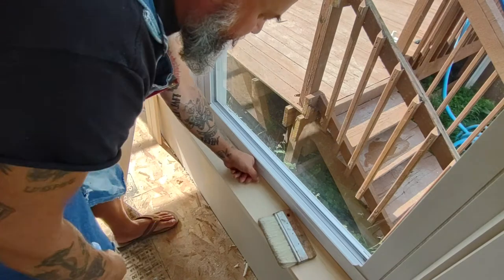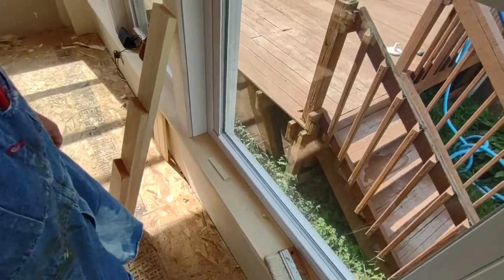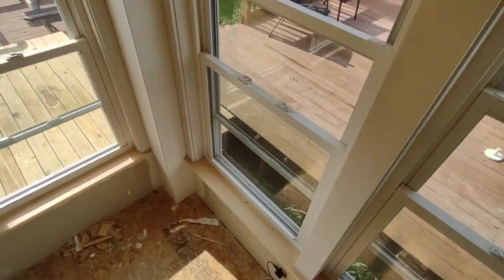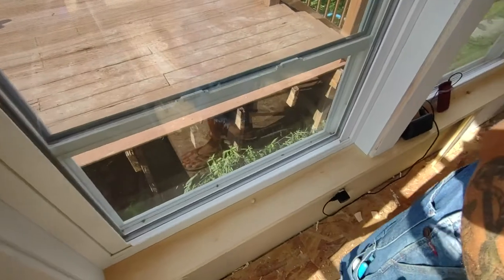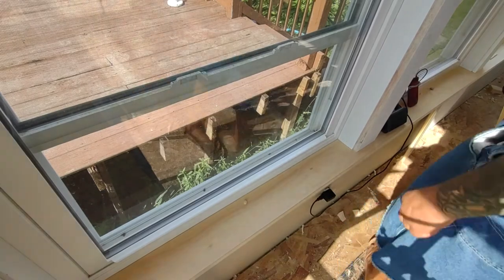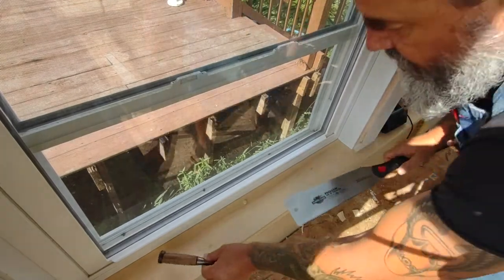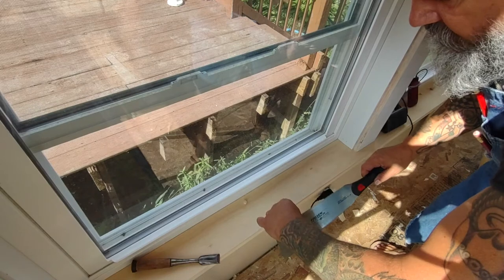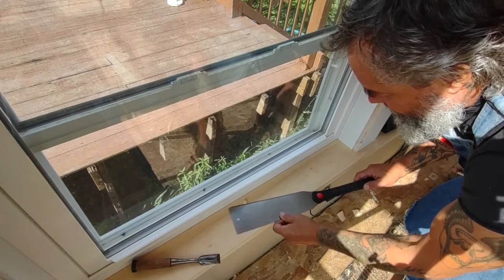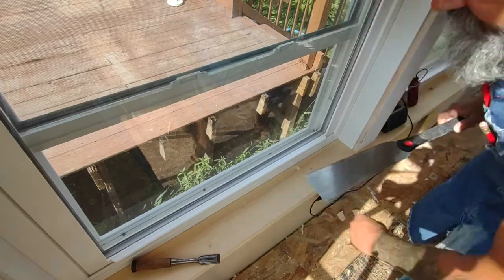My old one was getting pretty spent — the plug cutters aren't sharp anymore and the set screws are worn out from the allen key. Let me show you a plug I did a little bit ago. The beauty of the glue is that in 20 minutes you can be set up and working. I normally have a saw at home where I took the set off. I'm going to try not to scratch the top of this sill here. See — that's what you do: trim that.